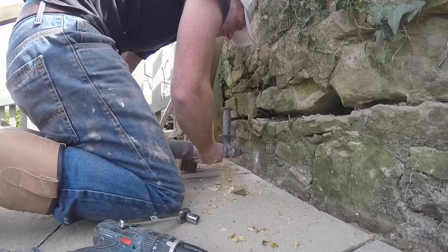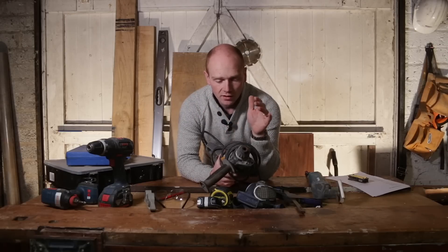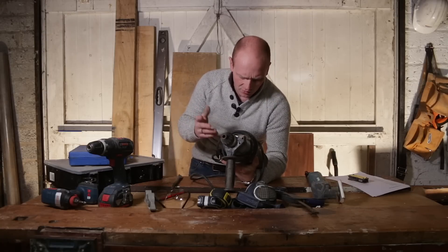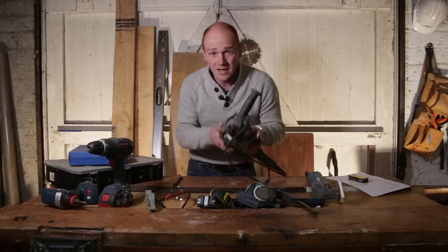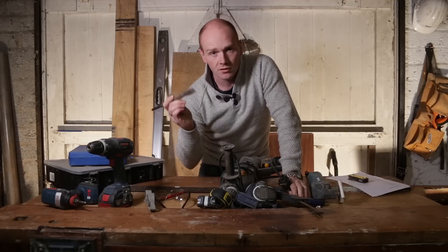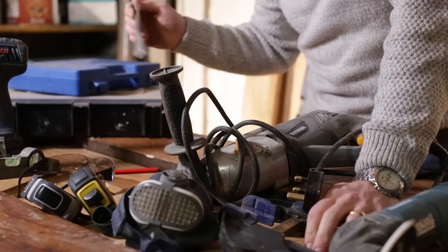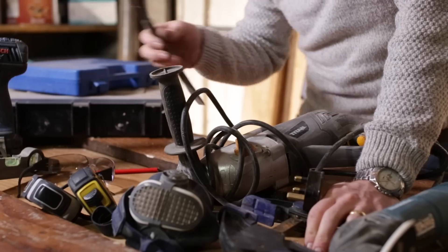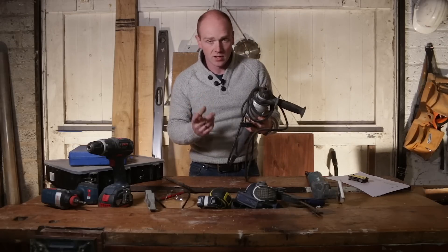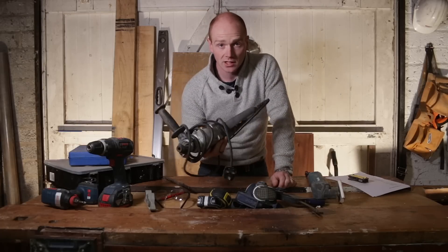If you're just drilling six or eight millimetre holes into concrete to fix a stud to the wall or drilling down into concrete, this is just going to speed up time. I think it's a 2.5 or 3 kilo model, but it's plenty of power. You can use all sorts of bits in it for demolition — whether it's flipping tiles off a bathroom wall using a wide bolster type bit to chisel everything off, or a pointed breaker bit for taking down a garden wall. It just has that hammer action without turning. A multi-purpose tool and one we couldn't be without, especially in a stone or brick property.